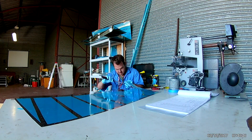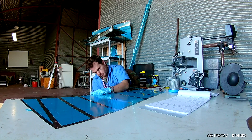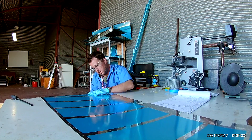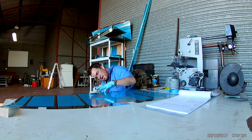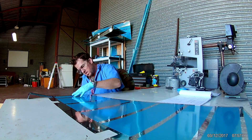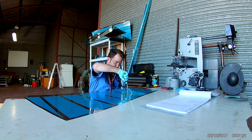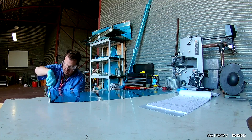Each skin has 283 holes — I counted them. For each one, you have to clean both sides. I'm not even counting the ones that you have to match drill. They don't ask you to match drill any of the ones for the stiffeners. You do have to match drill and final drill the ones for the different ribs — bottom rib, top. But for the stiffeners, you don't have to do any final drilling, which is nice. But you still have to deburr the holes on both sides.